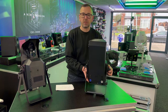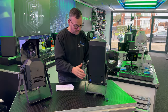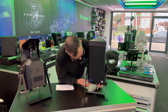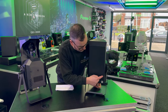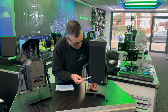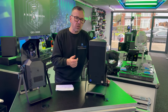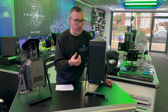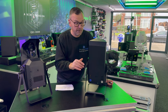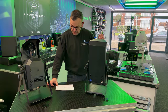These are early units — finished product but without screen printing on the back panel yet; retail units will have that. It's PowerCon in and PowerCon out for power, three-pin XLR for DMX, a menu on the back, and there's a quarter-inch jack socket for a CAA controller. That's a very simple three-button controller, but it won't control everything this fixture does — it's a very generic controller that will black it out, possibly strobe it, and things like that. You will be limited with it, and it is optional — it doesn't come with the fixture.